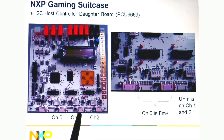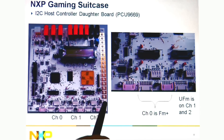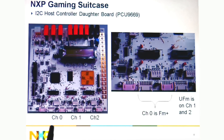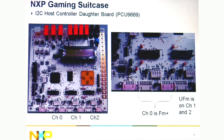And this is some close-ups of the boards. Here's the bus controller board. We have some test ports in here. We actually have a LED controller — I think it's a 9955, the constant current device — driving LEDs on the board, so you can actually drive load just on the board itself. It's got three channels: channel 0 is Fast Mode Plus and channels 1 and 2 are the Ultra Fast Mode channels, with different connectors going to the different boards.